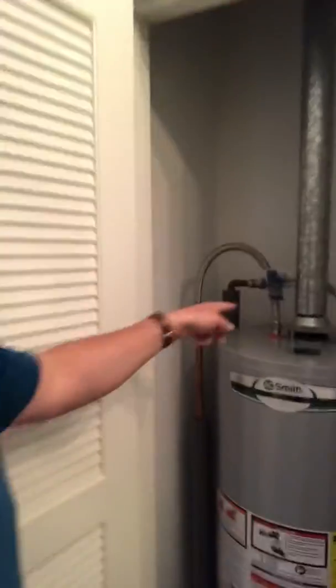And the main thing being the ventilation. Also, something to note with the ventilation, up above here, the rule of thumb is to make sure that that clearance for that vent as it relates to the pitch of the roof, there's a formula for that, the 2-3-10 rule, and you want to make sure that you're not getting a downdrafting with that, which we have that as well in this case. Clearances to windows out there, that sort of thing. So there's a lot in this bathroom.